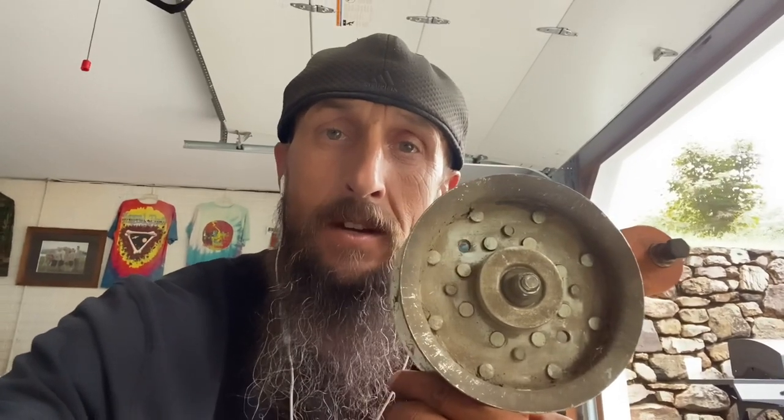The Turf Tiger 2 has over a thousand hours now, so things are going to start to wear out and break here and there, just like every mower. One of the things that goes bad after 500 hours or more is the tensioner pulley — the bearings seem to go out in these often. Some brands you just buy a new pulley and that fixes the problem, but Scag has a different way to do things.